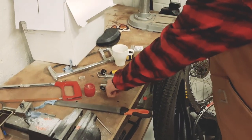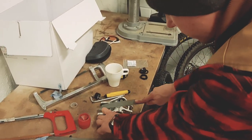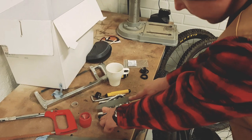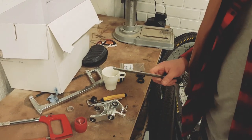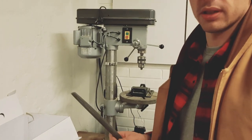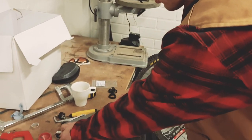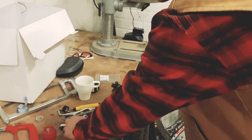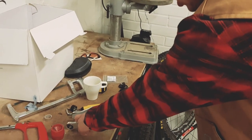The first prototypes are always a little bit rough, so we need to work with them by hand anyway. The first Evolinks — I snapped the rear triangles on the first ride because there was a design mistake by me. It was only 2mm wall thickness in some places and it started to break down. And then we just needed to live with it for a while.